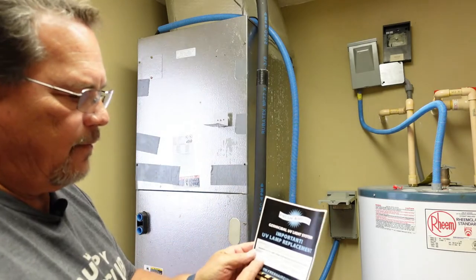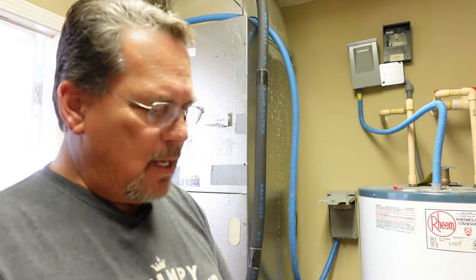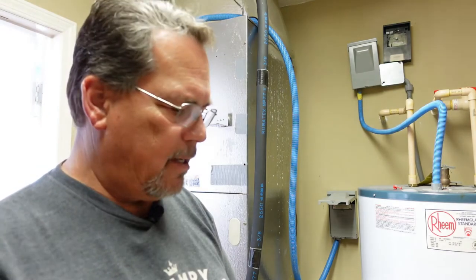Simple wiring — two wires on the 24-volt system. When this light is doing its job, it's going to further the clean air that we want. I'm going to fill out this little sticker label — you write the model, the date it was installed, the lamp model, replaced by, and it's got four different slots so you can notate when things were done. I'll fill this out and slap it on the air handler and we're good to go.